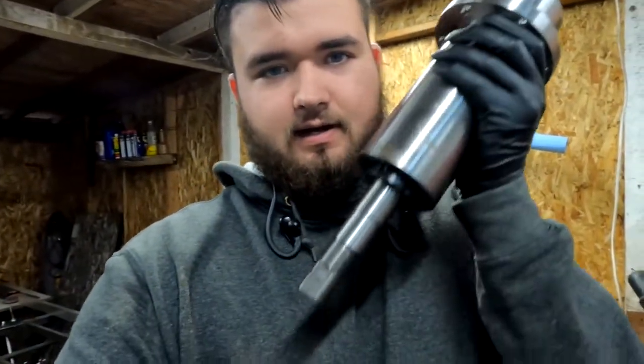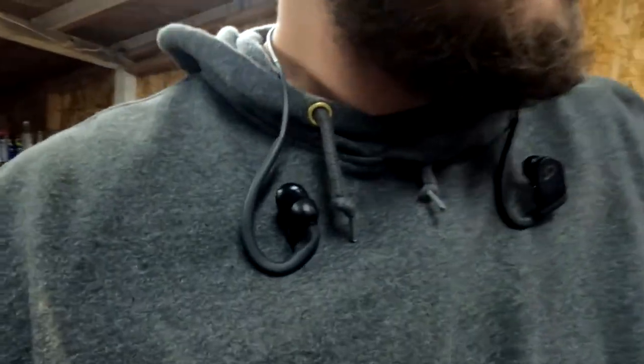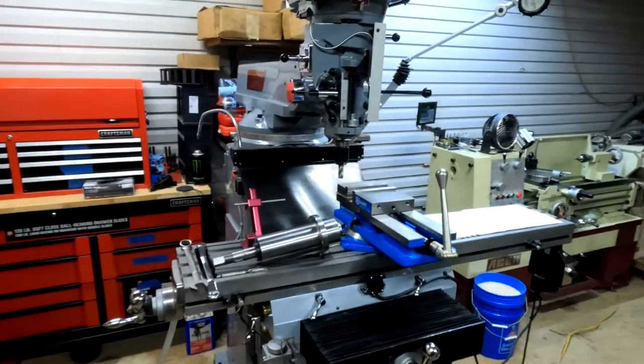This is a bit of a cross section — that's an individual one of those bumps. Another key feature of the machine that makes it very beastly is it's actually going to be featuring 10 horsepower. Generally router sleds are three to five horsepower — I think there's one out there that's seven horse — but mostly they are three to five horsepower, and the cutters are bolted directly onto the induction motor, so you're very limited on your RPM and you can also only ever use one cutter. This is an R8 spindle — extremely heavy — something you would normally see in a CNC machine that cuts steel.